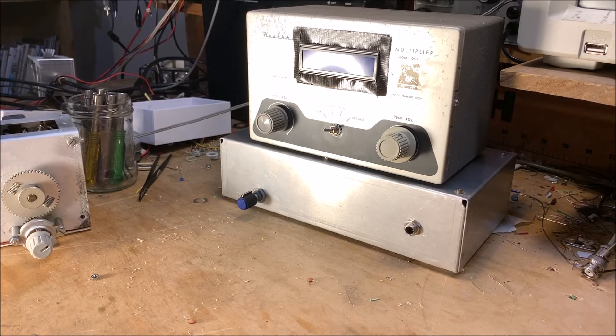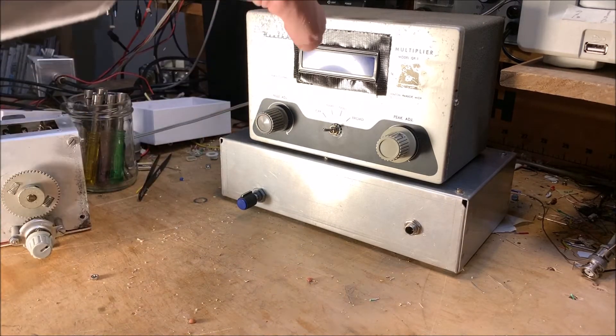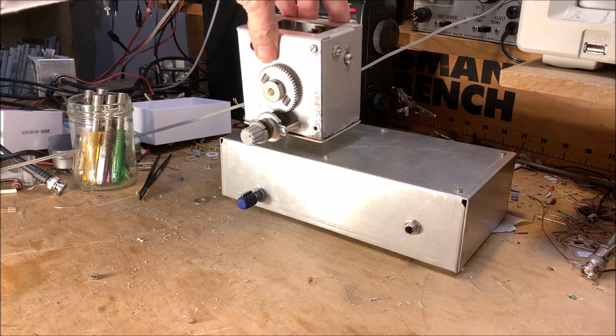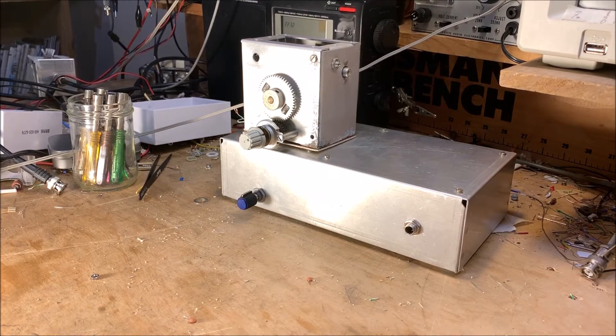So I went in this morning and pulled those three caps out. I didn't have to modify the low pass filter because it was originally designed for 40 meters and would cover 60 meters just fine. The low pass filter wasn't modified — the only modification was to the band pass filter — and I have extracted that modification.